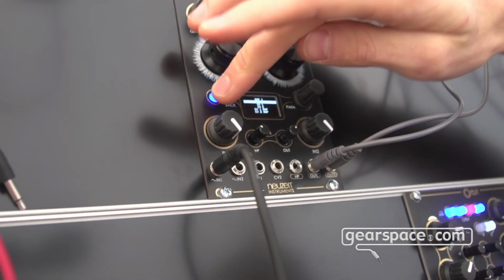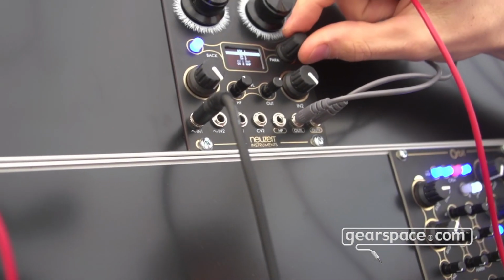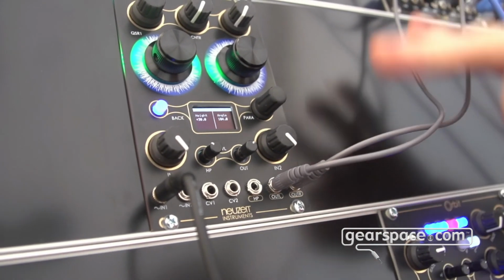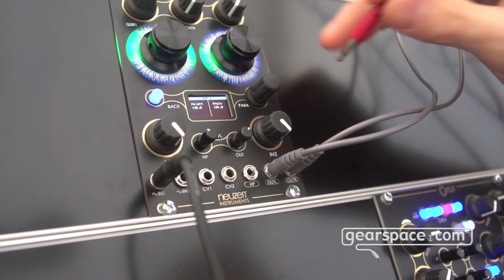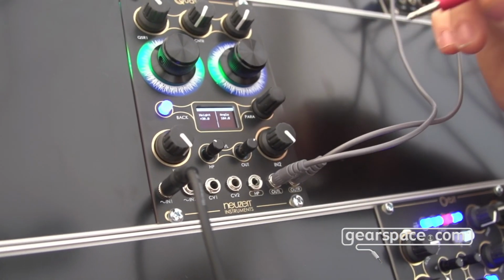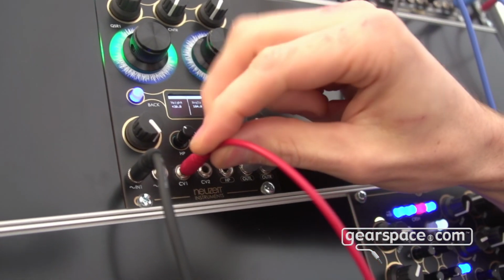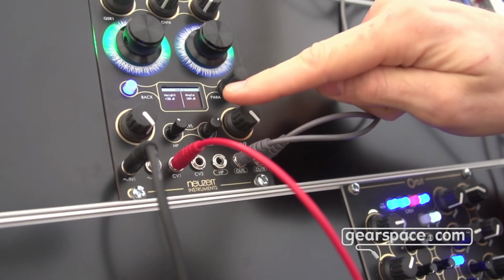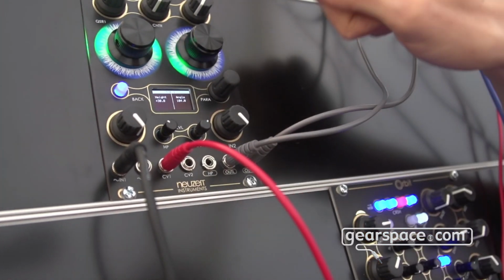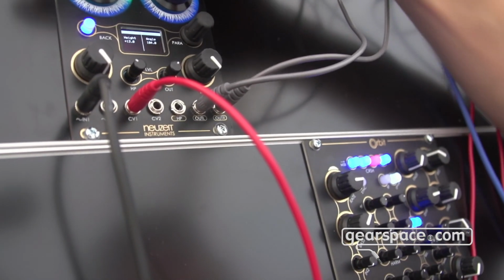We're in the modular world, and the modular world means we can do anything with a CV. So we also have two CV inputs, and these can be routed to any parameter we just covered, be it one of the positions, or one of the inputs or the filters of the inputs. So we can really map every CV to up to 4 targets. For example, I map this one to the angle of the first Quasar. This is a very slow sawtooth LFO, so this automatically rotates the position around our head.